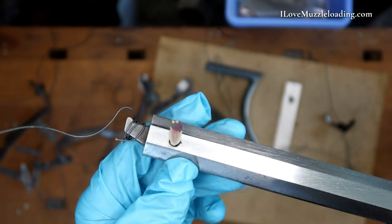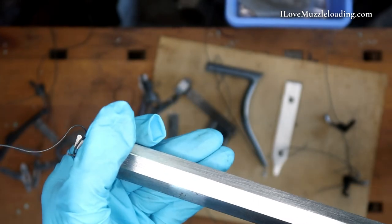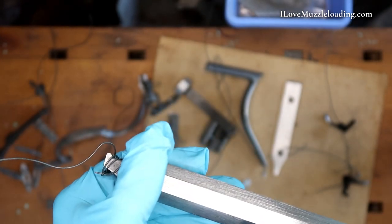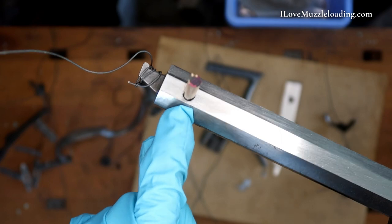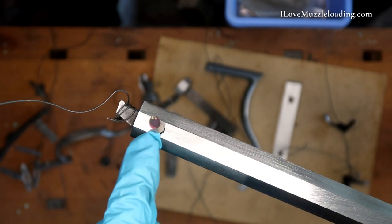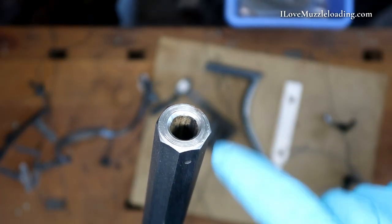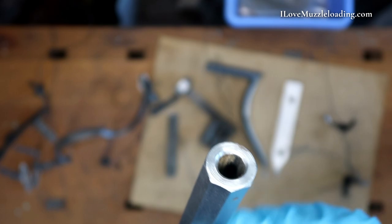The next step in my preparation was to make a small plug to go into our touch hole. I don't have the touch hole liner in here. If you have a stainless touch hole, you can go ahead and put that in — the rusting solution isn't going to affect it at all. Because I don't know necessarily if this is a stainless touch hole liner or not, I've opted to leave it out and put in a peg to prevent as much rusting solution from getting into the bore as I can. I'm going to be pretty gentle and apply the solution pretty lightly around the touch hole area. As far as our muzzle goes, I'm just going to be keeping the solution away from that bore.